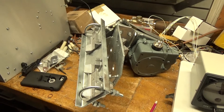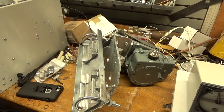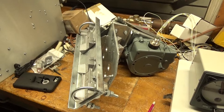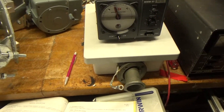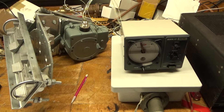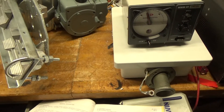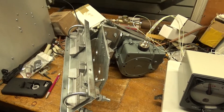When I go to the vertical side, the SWR is going to change a little bit because the vertical element will end up seeing the pipe that extends above the tower. But hopefully it'll stay below 1.5, which is well within the equipment's operating parameters. I believe in this type of current balun — some people use sleeve baluns and those work well also, but I've had better luck and seem to get more gain with this one.